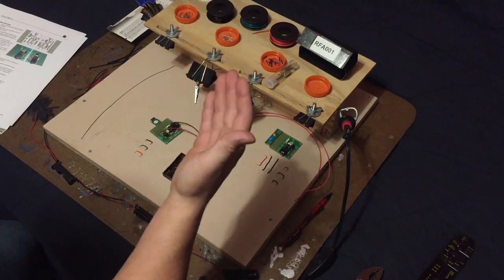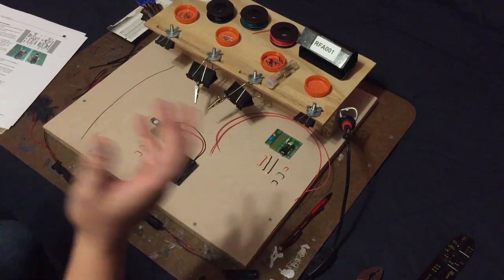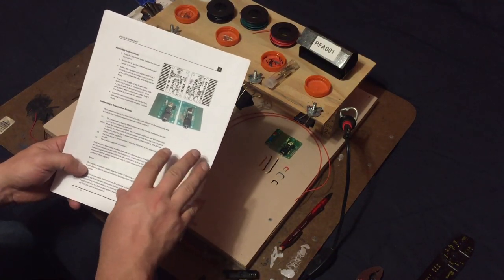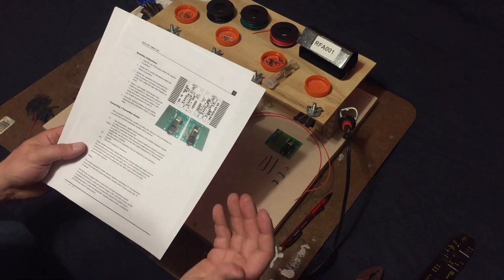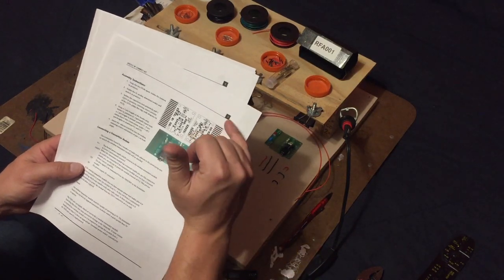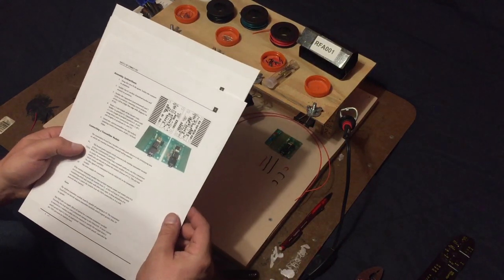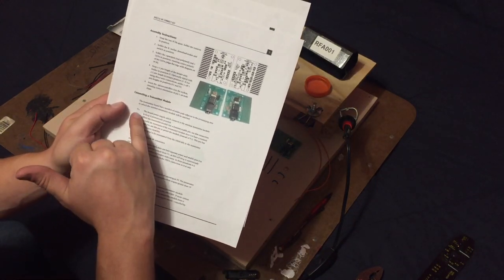But for this particular video and what I'm doing, I only needed to print out pages 5, 6, and page 9 of that PDF. Now, I'll link in the description to where you can find these, but page 5 is pretty much just the explanations of all the pinout sections on the transmitter board. That's these sections off to the side here. And they have little names on them. 0V for ground. TXEN is the transmit enable pin.